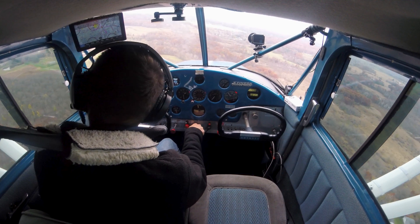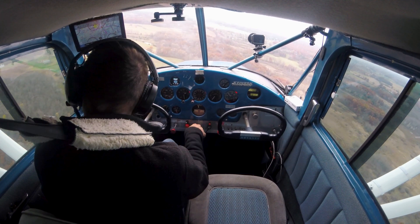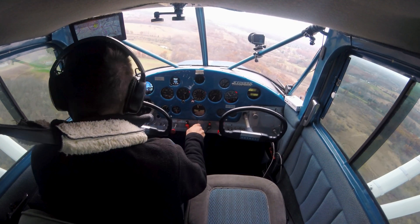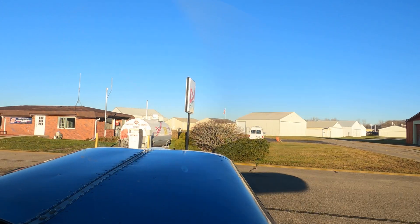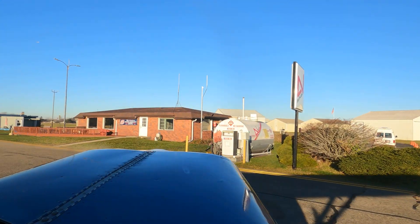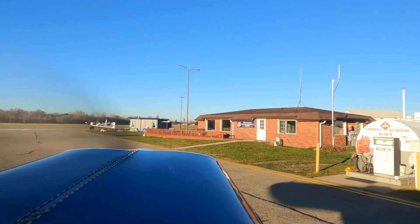The most asked question is how much faster? When you look at speed, it's a balance. Increase the speed, you increase the drag, burning more fuel and gaining only a little speed. That's why the old engineers designed these planes with an engine that matched the hull. You can toss a lot of horsepower and fuel to gain a little bit of speed, but unless you have large fuel tanks, you're not going to go very far.